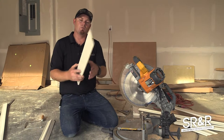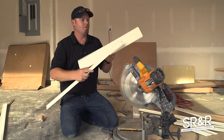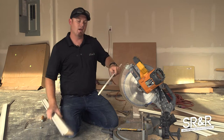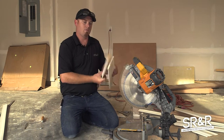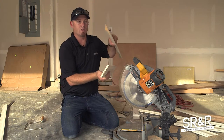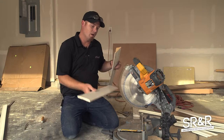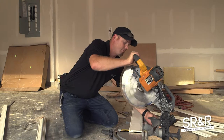Next we're going to do chair rail backer and the piece of chair rail. This little bottom piece is always on the bottom, so when you have this piece already mounted, your top is going to fit right across there to make this joint — caulkable on the top as it goes across. I want to show you how to kill this into a wall where it's flat. You're going to return this, and return one of these pieces into the back backer piece. We're going to use the same angles as the bread loaf handrail to make it look like it's coming out of the wood.